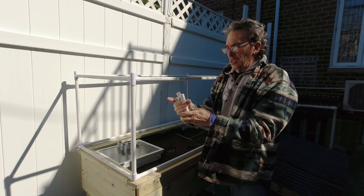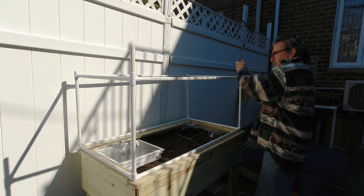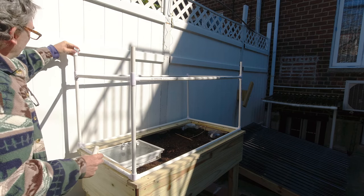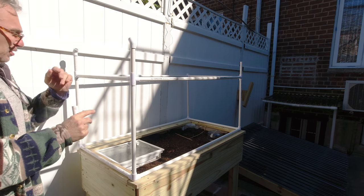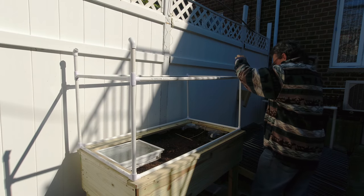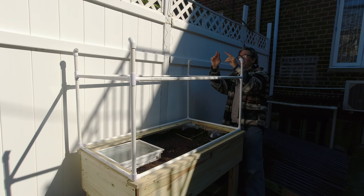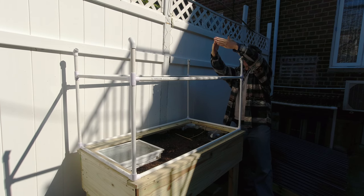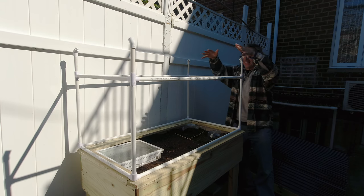Now I am going to need pre-cut pieces again. I'm going to lay them in here, and as I do that I am going to take 45s. I'll need to take additional measurements and put some three-way or four-way 90s to make my canopy — my top. This is where measurement comes into account. Now I can tee them off this way. If they made 30-degree or 45-degree angle fittings, then I could have everything slanted, but they don't.